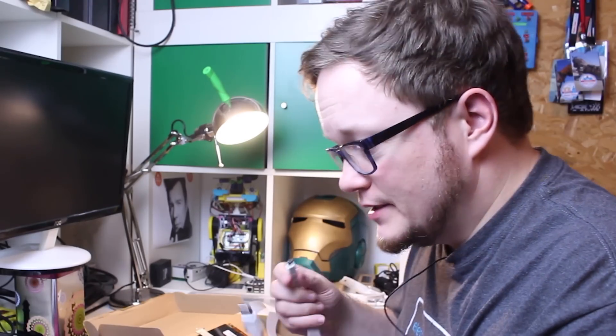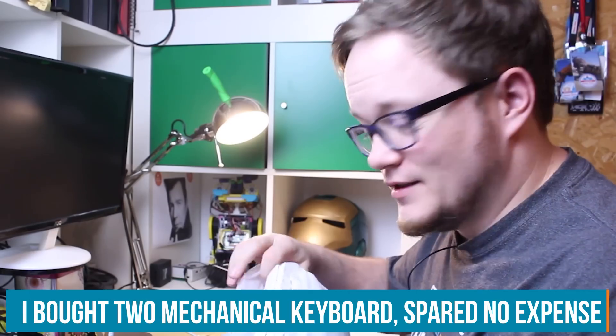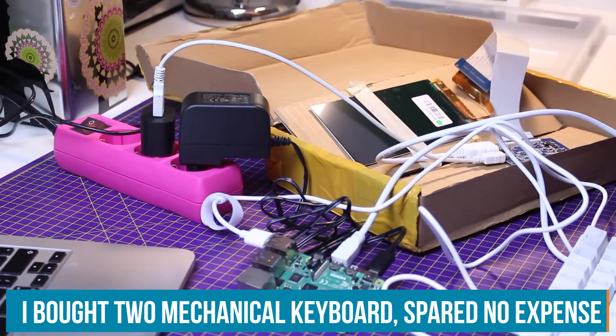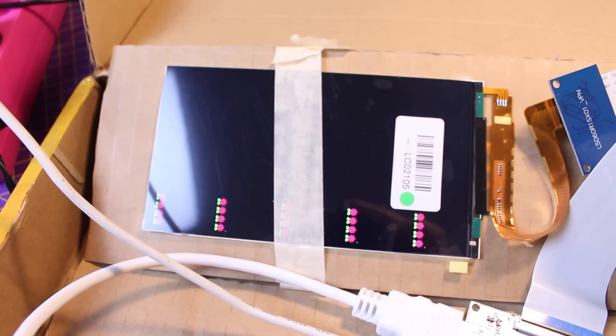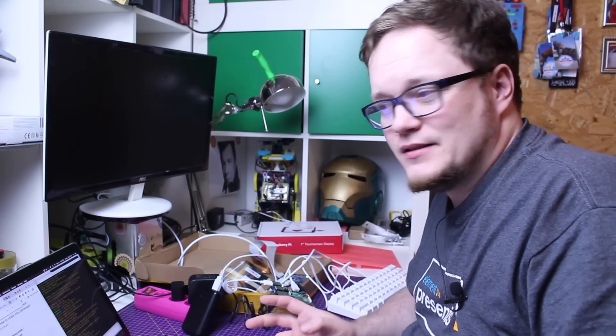I don't like plan B. I need a USB mini cable for that — it's like the oldest and newest standard working together in harmony. I got myself a nice mechanical keyboard. So there's definitely something weird going on and I think there's a fix for that. I have to find those files, make some updates, and then I have a picture on the display — but I was on the wrong HDMI port. Turns out that's kind of important. Now I have a very, very tiny display showing very, very tiny text. I managed to get it somewhat working but there's a defect — it flickers too much. I'm going to play the safe bet here and use the TFT display, the Raspberry Pi official TFT display.